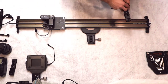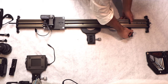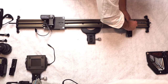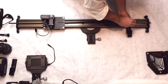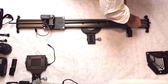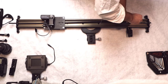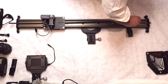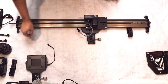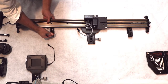We're going to add a few of these stabilizers, which also dual purpose as adapters. In case you have core boxes or other types of samples, we can mount and make different mounting adapters. But everybody has different specimens, different core lengths, different materials, so clients generally need to come up with their own solution to mount their materials. At the very least, these are excellent stabilizers beneath the system. To get the right stabilizer on, just gently move the carriage down the slider and add it on the other side, then gently hand tighten.